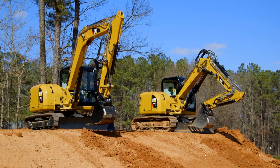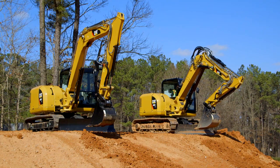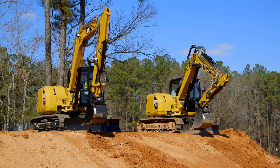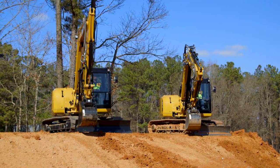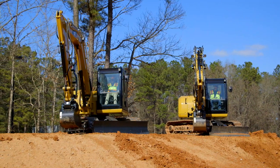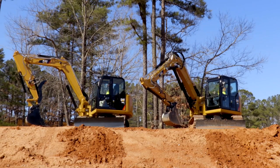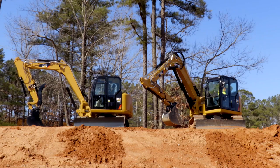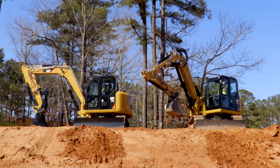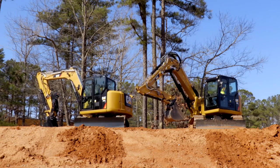We're now going to lift the linkages up, back around and look at working close to the machine. If you keep an eye on the standard machine, you'll see that you can only get so close. Using VAB I can actually work very tightly and close to the machine and can actually touch the machine on all four corners. If you imagine at this position, if I had a mower on this machine, I could go all the way down the shoulder or down the verge of the road mowing and cutting as I go. If I want to work around closer to the machine, I can bring that VAB all the way in and work nice and close.